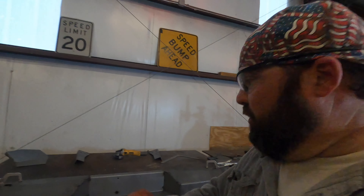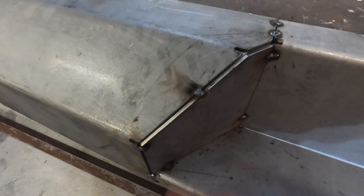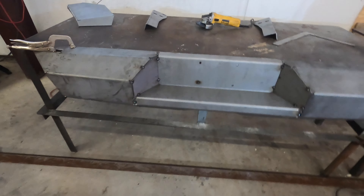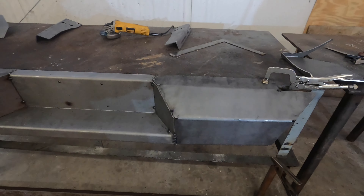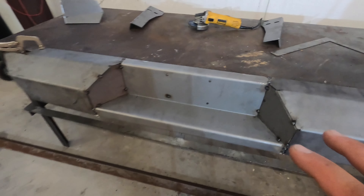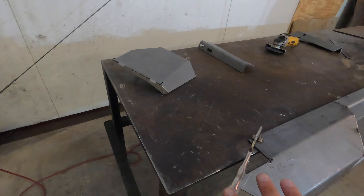All the front part is tacked together. I recommend tacking in good places where you can get the grinder in, in case anything isn't fitting right — you can knock that off or use a torch if needed. It looks pretty nice put together, and hasn't taken very long at all. I'm going to take this back apart, put a few tacks on the inside, and tack these end pieces on. I want everything tacked and ready before I take the old bumper off.